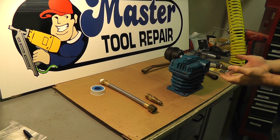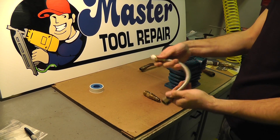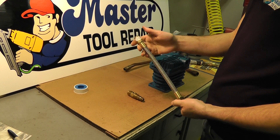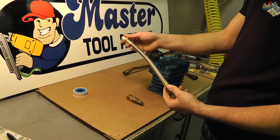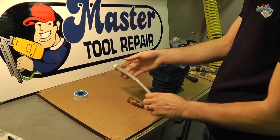How to convert a transfer tube from your original. Here we have a stainless steel braided flexible transfer tube. As you can see it is flexible, stainless steel braided. You have your pipe fittings on either end — a male pipe fitting and a female flare swivel on the opposite end. We have a check valve.